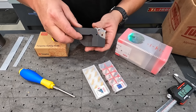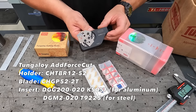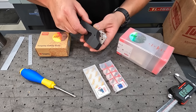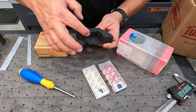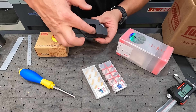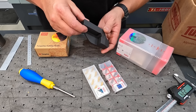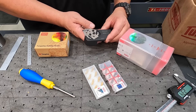They recommended the AD Force Cut, and this is the one sized to fit the Milltronics ML 16. They have these in a lot of different sizes — this is the smallest one they make, with a 50mm body and 25mm cutting diameter, so about two inches. It holds like a traditional stick tool with two contact faces: it sits like a standard turning tool but also contacts the turret face, so as tool pressure is applied it pushes into the turret for added rigidity.